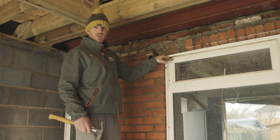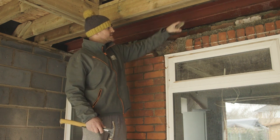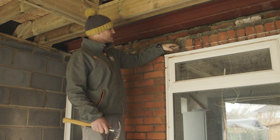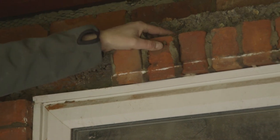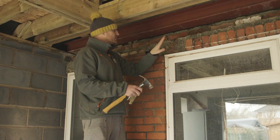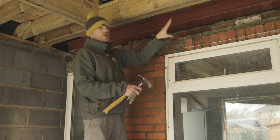So you can see on here, this is not the way to do it. You've literally got all this old brickwork, which would have been higher, sitting on the window. Somehow it's still opened. But usually you'd expect to see a lintel under this. Whereas here, you can just see they're all just hanging on with silicone without a lintel. Luckily for the customer this has worked, but I would strongly advise any new window or door - put a lintel above it to take any load above.